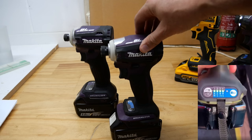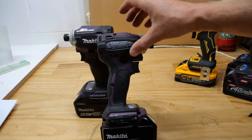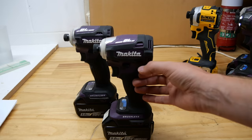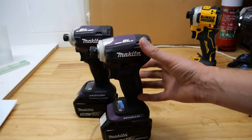So you'll likely have all the same features: bolt modes, tech modes, wood screw modes, that sort of thing. When we look at the numbers, you're not going to get any more power — if you're expecting something to smash screws in faster than Milwaukee, that ain't going to happen. It is still 180 Newton-meters, like the DTD172, and all the speeds and impact numbers are the same. It's probably pretty much the same tool in a different design body, with the controller at the back, weight distribution shifted, and a narrower nose for getting into finer spots.